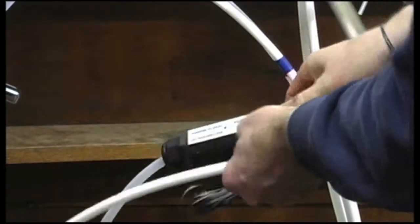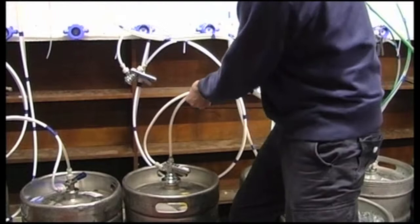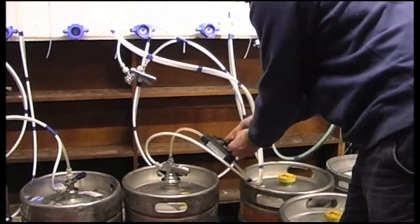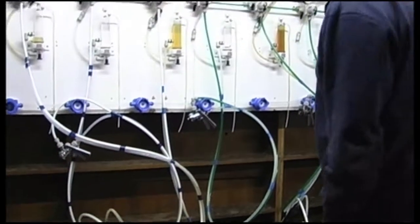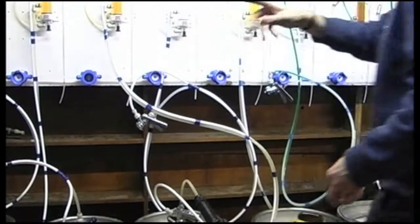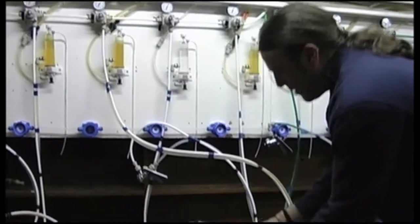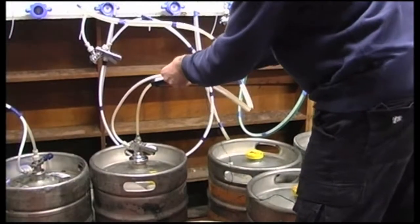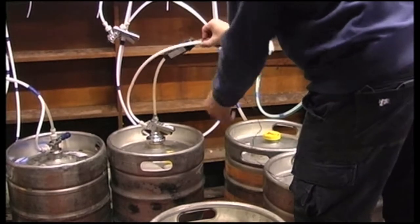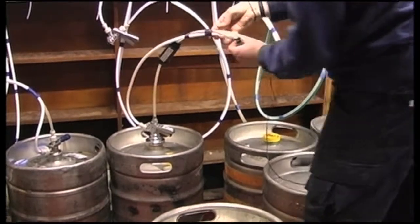Please note there is no order to the direction of the BeerTech conditioning unit being slid onto the beer pipe. The BeerTech conditioning unit should be locked at each end, approximately 30 centimetres or 12 inches from the broach head. Locking the unit is done by carefully tightening the end of the unit. It is also beneficial to tape the gas and beer line together at each end of the unit, also helping to stop slippage, if any. This will keep the unit snug when kegs are being replaced. This process is repeated over the remaining kegs that require the BeerTech conditioning unit.